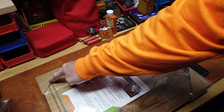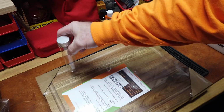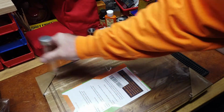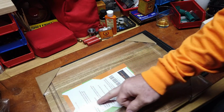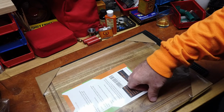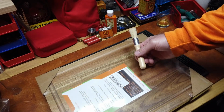So I'm thinking I'll just rip the ends off here and cross-cut those ends and then glue three pieces high and cut through probably 1.5 inches, maybe 2 inches, so that my vials are secure and I can pop them in and out easily, and put two holes for my handle and do some countersunk nuts on the bottom once I thread the little 3/16 stock bar, and then a couple of holes for a brush, a funnel, if I'm going to keep this funnel or go with something else.